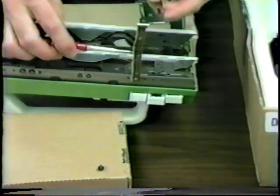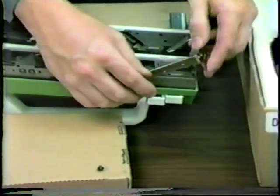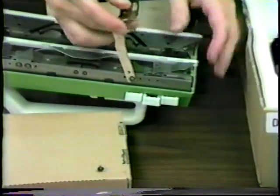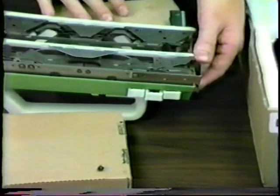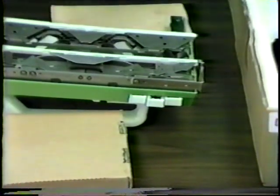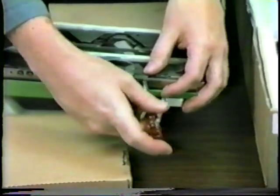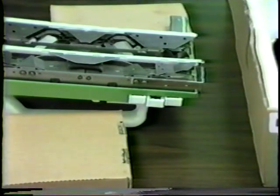Now carefully pull the deco bracket over and snap it in place. The two protruding pieces will fit into the indentations on the ground plate. Now put in the second dark gray screw with point. Be sure that there's a washer on it. Now put in the first screw that we removed.